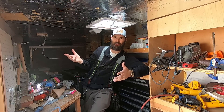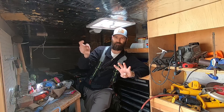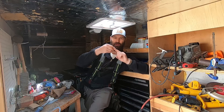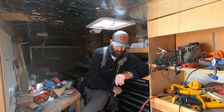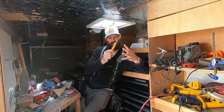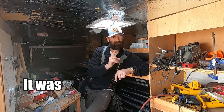Keep in mind, this is an outside panel — just crazy laws in certain places. There are about four circuits coming up that go into various breakers. Some have two hots coming in wire-nutted together with a pigtail to another breaker — not the best idea. I take out my tool and I have these four wires that are going to the basement. I test them and go up to find the breaker. It looks like it's on, but it's not.